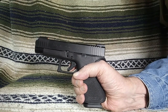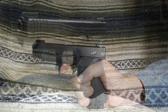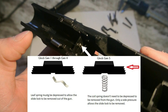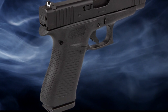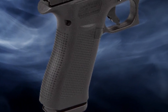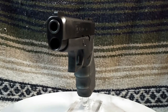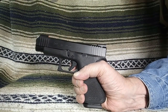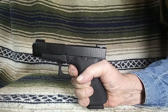The trigger is very smooth and rolls through the wall before releasing the striker — that's the firing pin for us old folks. After a round is fired, you only have to release the trigger until it resets, which is minimal and which you can feel. Returning to the frame, the takedown lever now has a coil spring rather than a leaf spring. The G48 exhibits Gen 5 grip texturing that provides enough gripping surface but yet is not obtrusive to the hand. Some, in fact, say that the texturing is not aggressive enough, but that is a personal thing and there are ways to rectify that. You can re-texture the grip or add a grip sleeve that does not alter the original texturing.